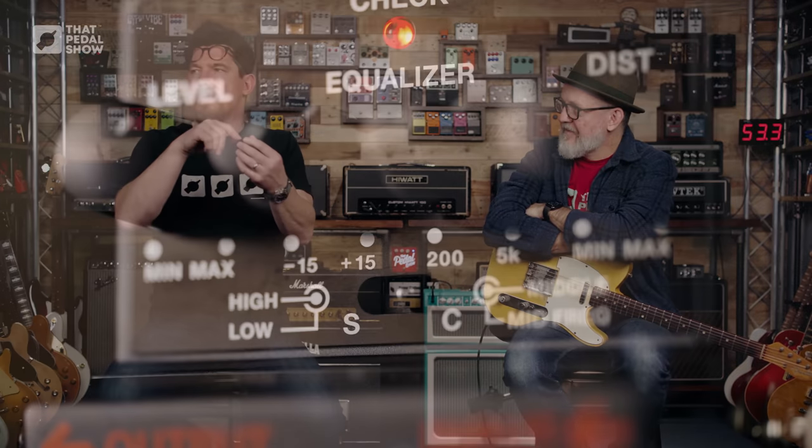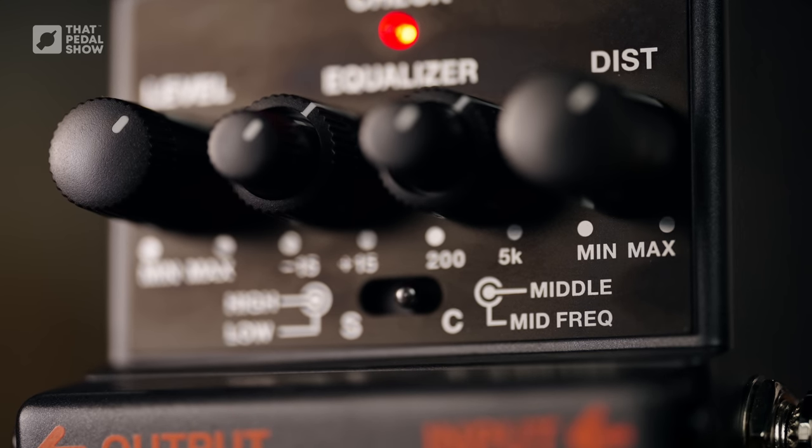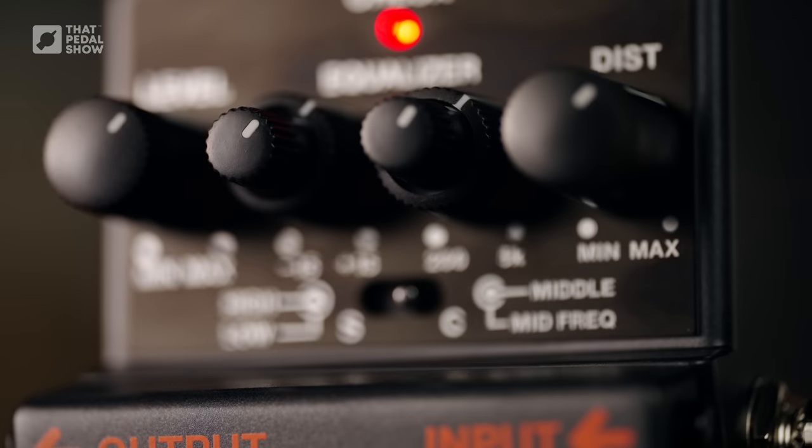Sure. Interesting. What I found interesting about that, though, is the gain felt closer. The attack felt closer. And you think that's because of the hard clipping? I think, because the diodes are in a very similar place. Really, really interesting. Certainly extremely versatile, but it almost feels like you've got the dual concentric pot there with the semi-parametric mid on it. It feels like if you could spread that much travel across the whole knob, that would be enough. It's so sensitive. It's crazy.